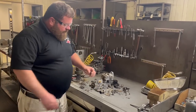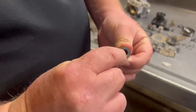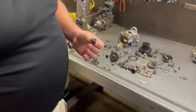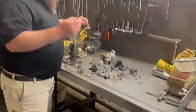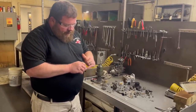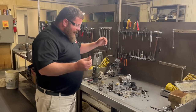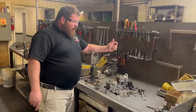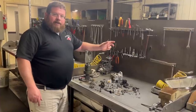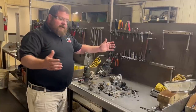Cam and rollers we already knew we were going to have to replace. The pin that was broken is in this component here — there's the busted-off pin, and that was really what stopped Frank in his tracks and why we got the pump. We'll beat that out of there — you can actually get in on the back side of this same widget. Once this thing is out of the bushing, you can drive the pin out the other side. We'll get a cam plate, a roller kit, a gasket kit, do a more thorough cleaning, and bring you back when we start putting this thing back together.